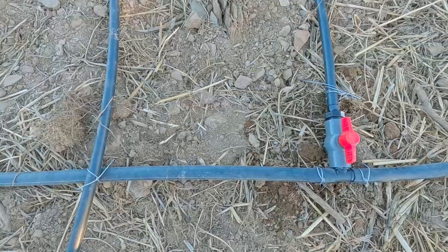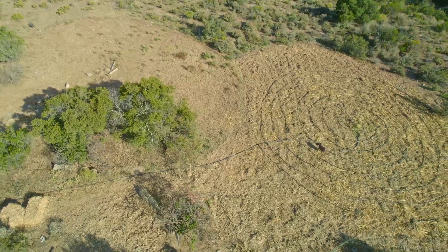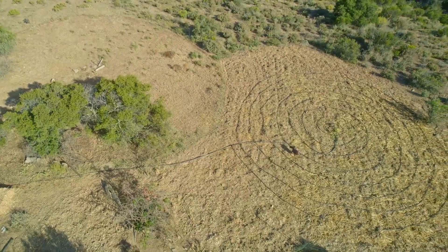Lastly, you can add something like an air valve somewhere on the high side of the system to facilitate the water filling the pipes and get water spread through the grid quicker. It also helps mitigate water hammer. I haven't done that yet but I'm definitely going to, because I can see that on the far and lower end the emitters start flowing at least 20 seconds after the first emitters on the line start flowing.